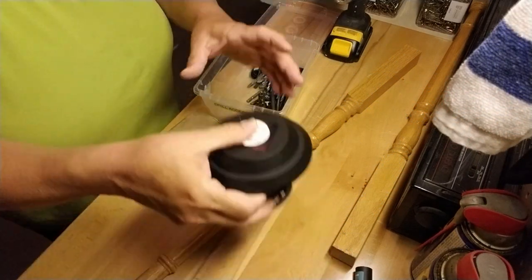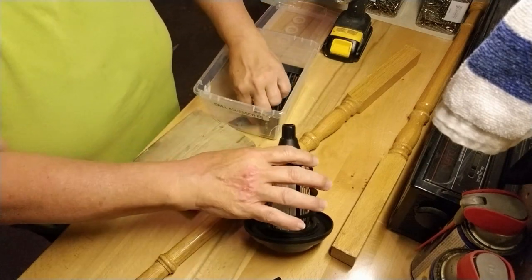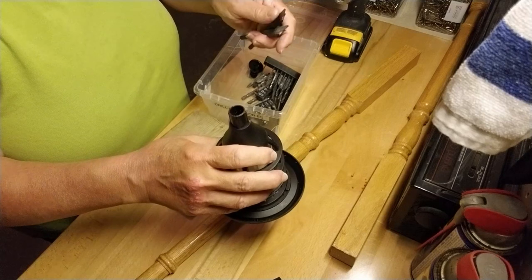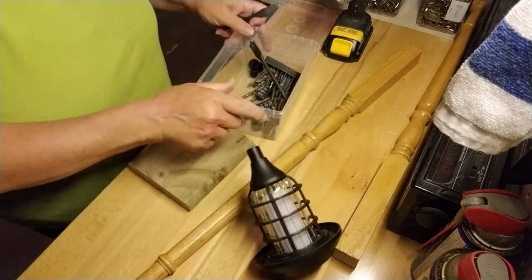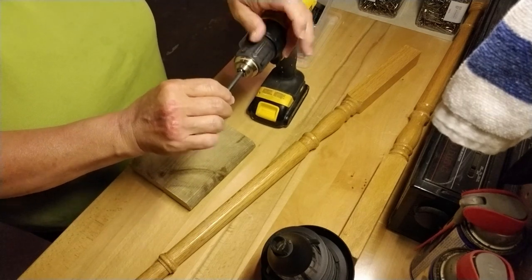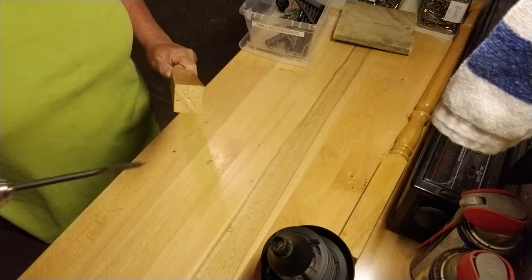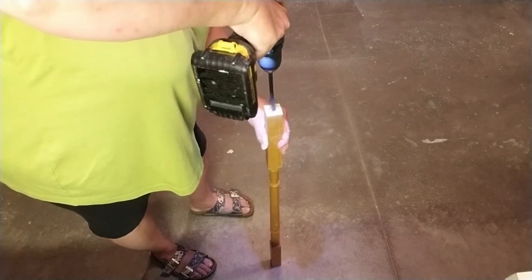I love using spindles in home decor and garden decor, and I'm going to be using this solar light and attaching it to the spindle. The first thing I need to do is figure out what size of spade bit I need to drill into the top of the spindle. Spade bits give you a much bigger hole, which is perfect for this project. I need to make sure that the bit is just a little bit larger than the bottom of the solar light, because I want to be able to wedge it in and not have to use any glue. The top of these spindles already have somewhat of a little hole there, so that's the perfect spot to start with the spade bit.